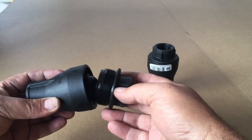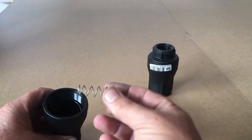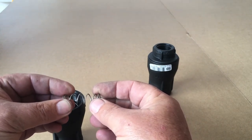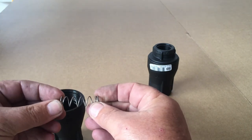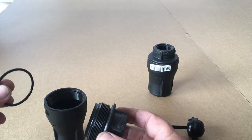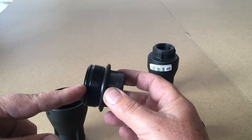To dismantle and clean the one-way valve, the end cap screws off. Here we see in the center the plunger and the return spring. This return spring is one fitted at the factory and it is stronger than the original spring. These can be stretched by four or five millimeters to give extra tension when required. There is an o-ring that will fall off every time it is dismantled.